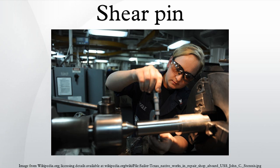Their high reliability and low cost make them very popular for use in weapons. A typical example is using shear pins in an explosive device. A shear pin can hold a striker pin in place, preventing the striker pin from striking an initiator unless the correct force is applied. That force can be the acceleration of a grenade being launched. The force would snap the shear pin, allowing the striker pin to move backwards onto a primer, which in turn ignites a pyrotechnic delay composition for auto-destruction. In this use, shear pins prevent the striker pin from hitting the primer during handling or if the grenade was dropped by accident.